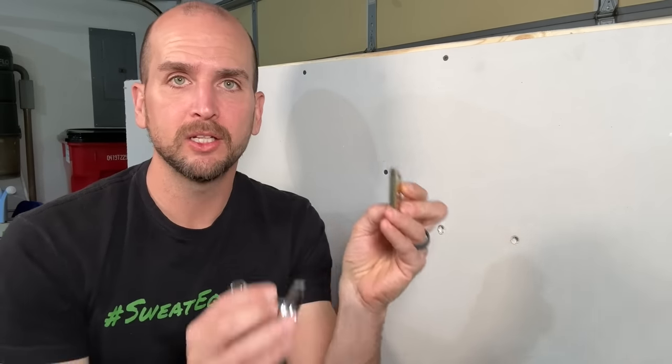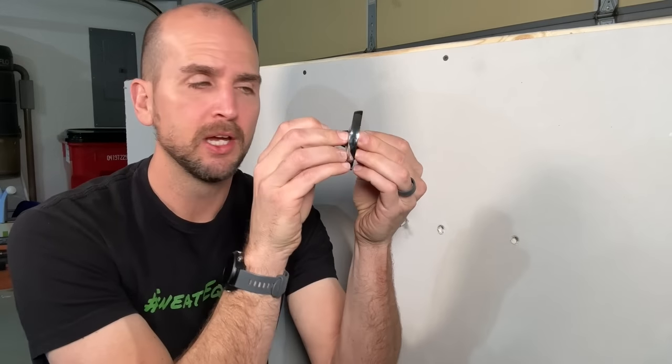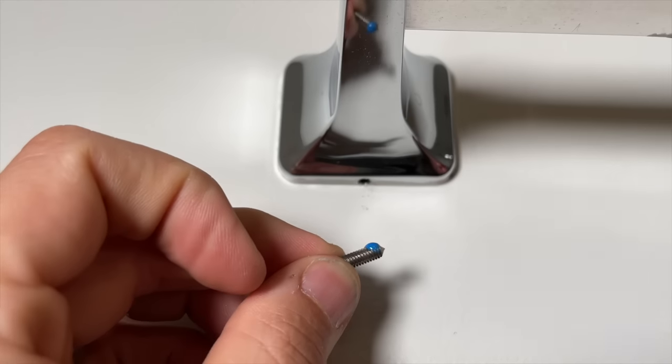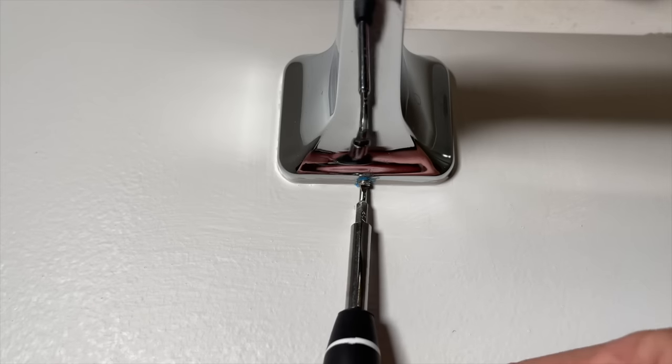One other tip: if you're setting hardware like one side of a toilet paper holder, you get it mounted to the bracket and start to tighten your set screw. Before you tighten it, put one drop of Loctite thread locker — specifically the blue. The blue is a temporary hold compared to the red which is a permanent hold, but it will keep that set screw from backing out over time and loosening up from your wall. Just another tip to reduce the amount of maintenance around your home.